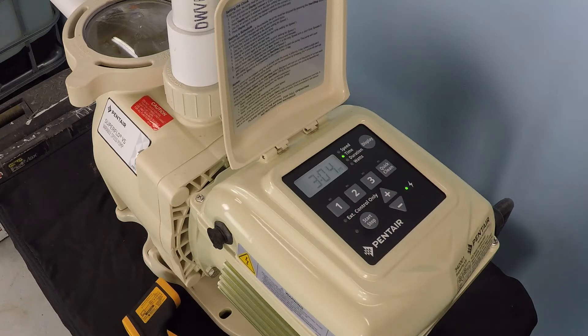Typically speaking, you'd have periods of time every day where your pump needs to run at higher speeds. That being said, variable electrical rates are common pretty much everywhere now. There are off-peak rates, and for maximum savings, you want to program your pump so the high-speed portion of your 24-hour filtration cycle falls during an off-peak electrical time, so you can experience the maximum savings from that.